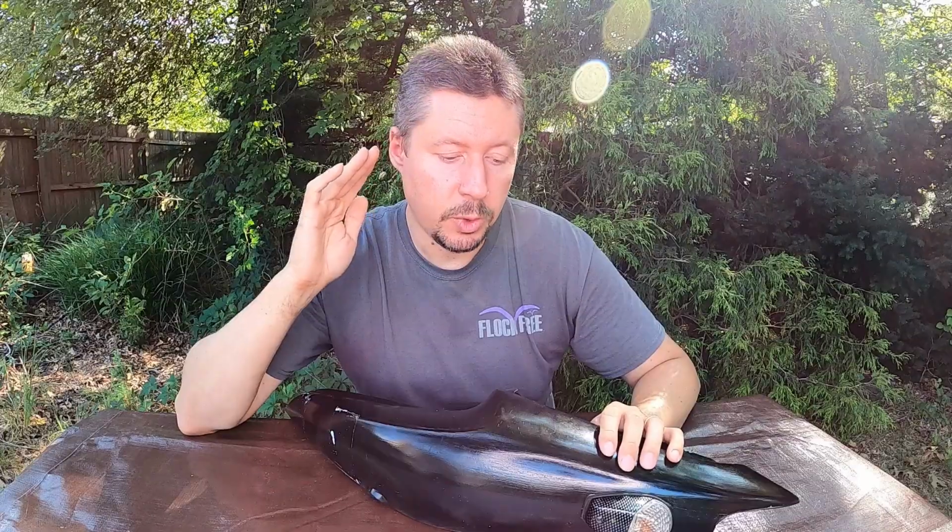So I'm first going to sand it with 120 grit, then I'm going to fill all gaps and sand it once again with 120. Then I will use 220, and then I will repeat the process with 320 grit sandpaper, and I'll stop at this moment. Then I will paint it with a primer. Some universal primer in this case, but you should better use primer for plastic. Then I sand the primer with 400 grit, and then I will paint it.